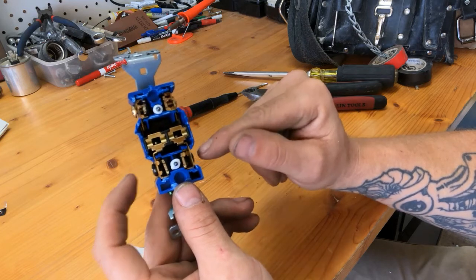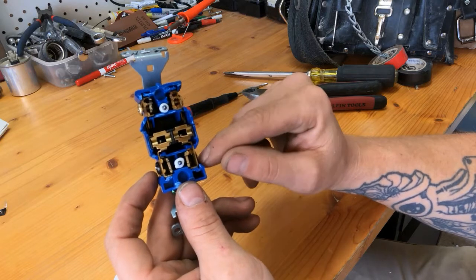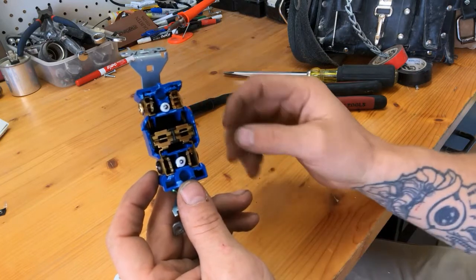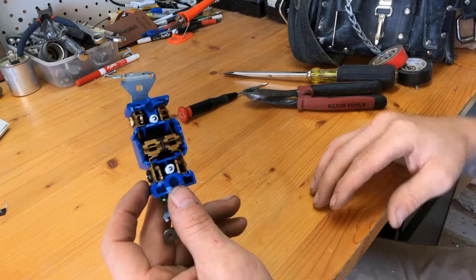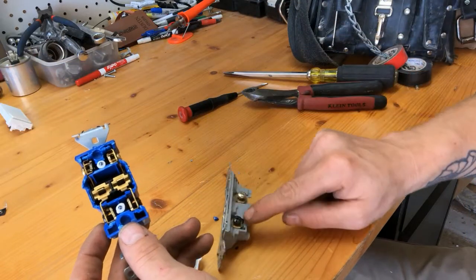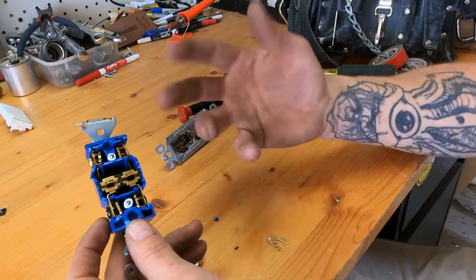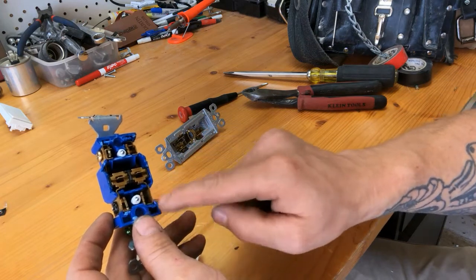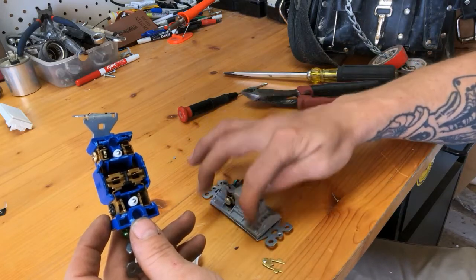When you're switching one of these, you're switching both of them. So essentially when you go down, it takes one of these terminals and connects it to this path. And when you go up, it takes this terminal and connects it to this path. Either way, there are two different ways that current can travel - just like a three-way, where you've got one path that can be traveled along here, and one path that can be traveled from the black to this side. It's the same exact thing - it just allows an input from two different directions, whereas the three-way only takes an input from one direction.